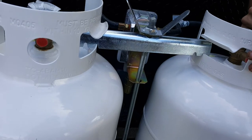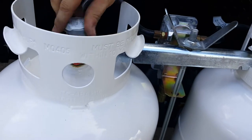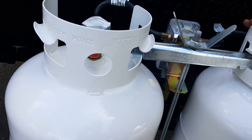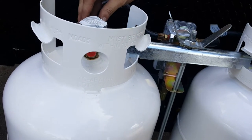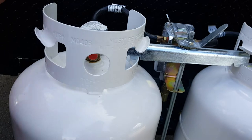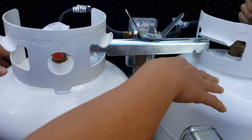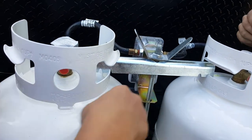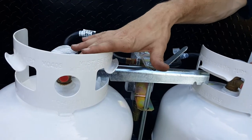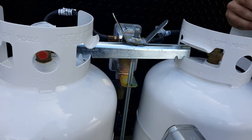When you do a refill, you come here, shut both valves off, and unscrew the tanks. The tanks are both filled up for you right now. With this regulator, it's going to draw from one tank first, and then as soon as that one's empty, it'll automatically switch over to the other. You won't have to change anything — it'll do it itself.